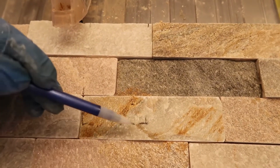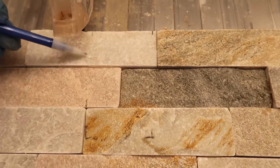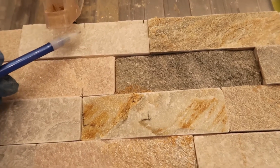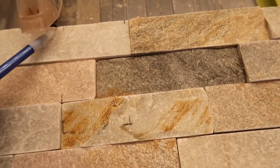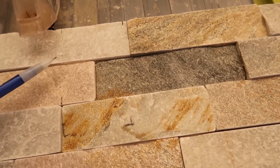This cut we'll have to do with a Dremel tool probably, see if that works, and then we have this cut down this side to that mark. The only problem is the wet saw will erase that pencil mark instantly when the water hits it. So I'm going to have to put a permanent marker on here, which is okay because I actually have to grind the edge of this down a little bit so that I can fit the electrical outlet plate onto it.